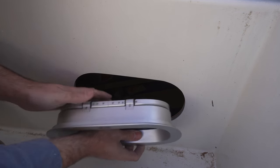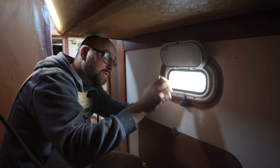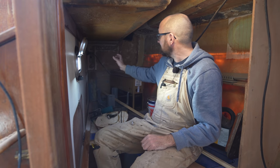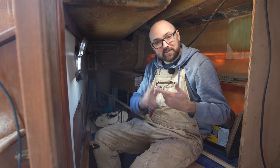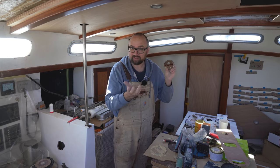This is a mighty fine looking hole if I do say so myself, and it should be a nice snug fit. This seems like a really nice quality port light. If only they had included the cutout dimensions for the hole then I would have been over the moon, but well, you can't have it all. I don't know if the difference shows up on camera, but there's a lot more light in here now, which is really nice because next week I'm going to start building a little enclosure down the aft end of the aft cabin for the inverter and the isolation transformer. After a quick little test fit, it turns out the new hole saw is the perfect size for the new deck fills. So let's go ahead and get some holes drilled.